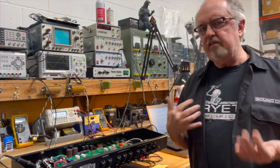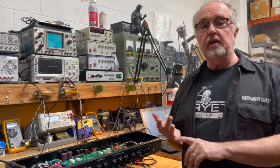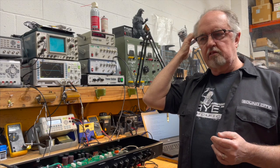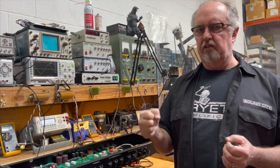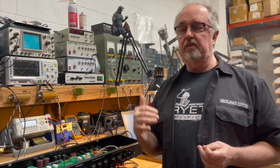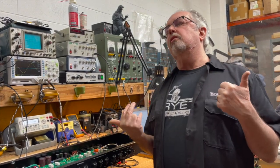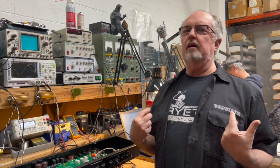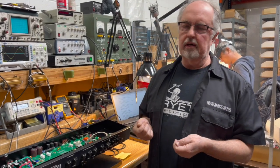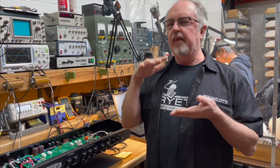So where's the overdrive saturation coming from? It's coming from the phase inverter mostly, because now the phase inverter can't drive the tubes as hard because it hasn't got enough voltage. It's not pushing the tubes more into distortion because the phase inverter actually can't do its job of pushing the output tubes to full output. So you can't call it power tube distortion, except in that the distortion is coming out of the power tubes, but they're not generating it. The phase inverter is generating it. That's what gives it that characteristic bouncy squish.